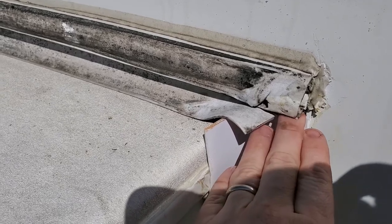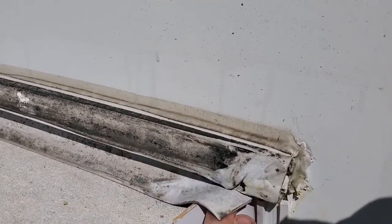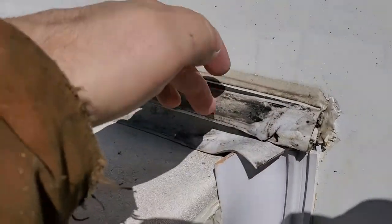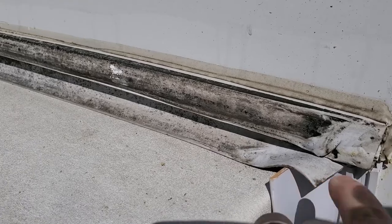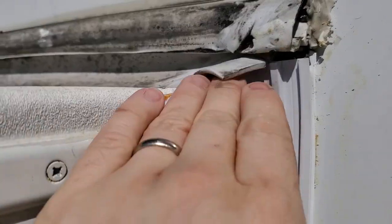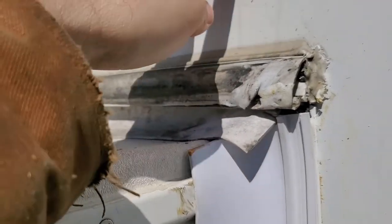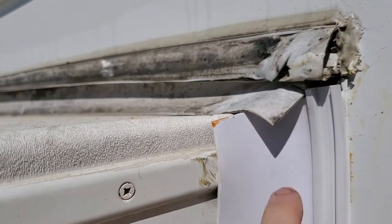I have my new flapper seal installed, put right where the old one was. The old one on the top is still in place because I need to know where to cut my new seal — you want this top one to overlap the bottom one so when the rain comes down it runs off. I'm going to cut this seal right along with the roof, so the new flap will lay right on top and cover it. When it rains, water comes down and runs off. It's cut at an angle going up so the new roof seal will come clear out to the edge and fully cover it, with a lip that hangs off. You want to make sure your top seal covers your side seal — because rain goes down, not up.